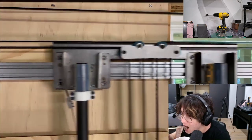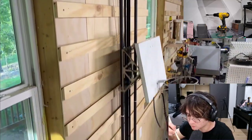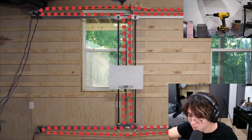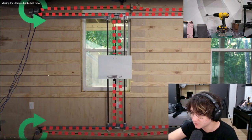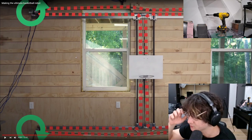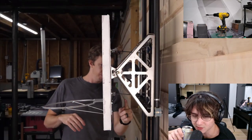The real reason I have all these belts is because I need the motors to be stationary — they're way too heavy to move around quickly, so I'm transferring all their power with belts to move the hoop. I have one continuous belt — this is the really long one that's just waiting to explode in my face. The final position of the cart is a combination of the position of both motors. It's like a variation on the CoreXY belt-driven CNC system.